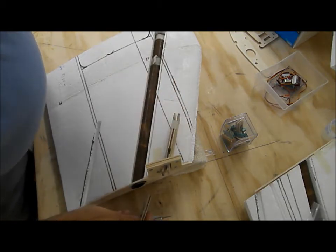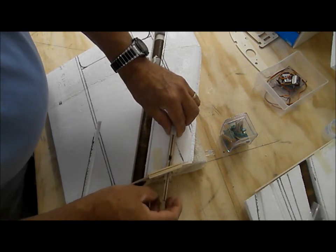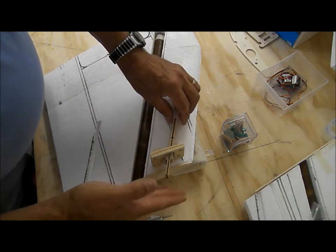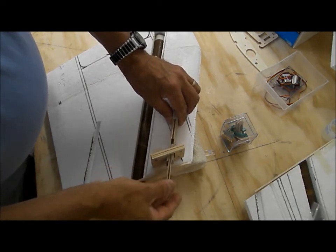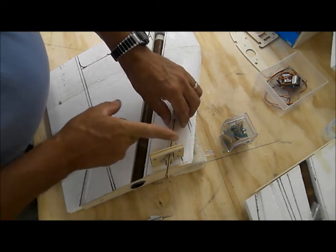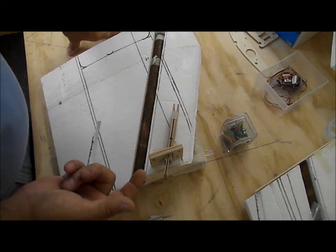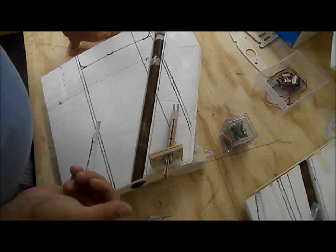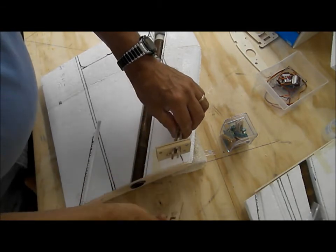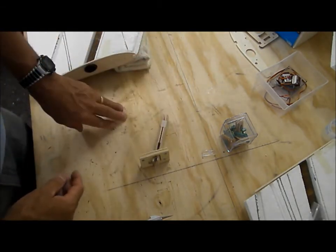So whenever you slide the tubes in, this tongue is actually going to wind up sliding into this groove, and of course it'll slide in until the two ribs butt, and then to slide it out you simply just pull the wing apart. So now what we need is a pin that goes in here to lock this, and that pin needs to be actuated in some way so that you can lock and unlock the wing. So let me move all this out of the way, and now I'll show you the locking mechanism.